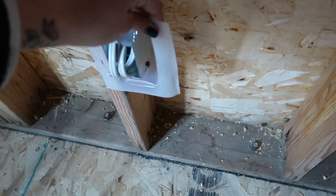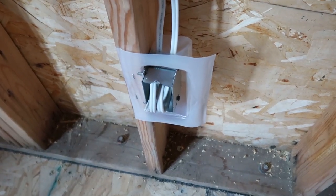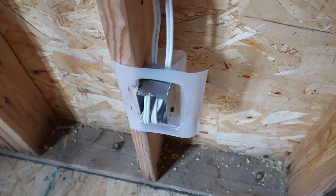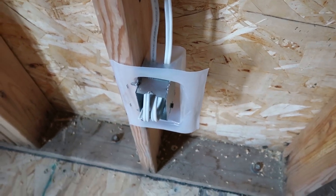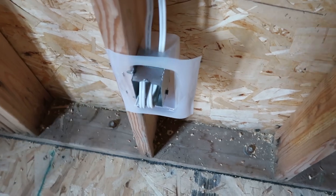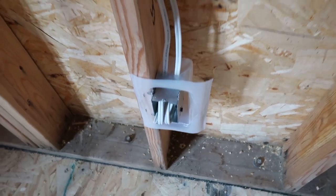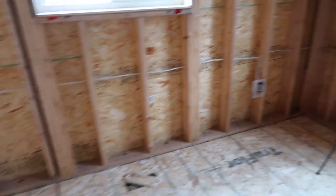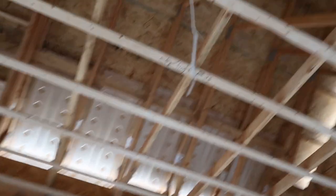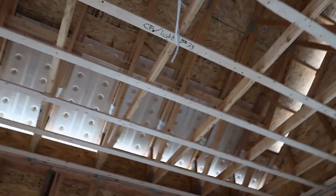This is an exterior wall that will be insulated and vapor-barriered, so you have to use vapor barrier boxes. You don't have to use the dedicated vapor barrier box itself — you can make your own, and there are different electrical boxes that are already sealed — but this is the easiest, cheapest, most convenient way. That's Damien's room done. We haven't touched any of the ceiling light boxes yet; we'll do all of those at the end.